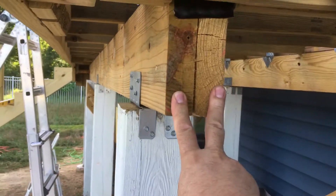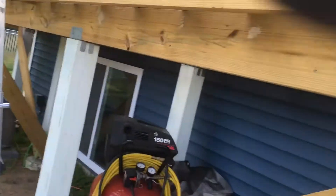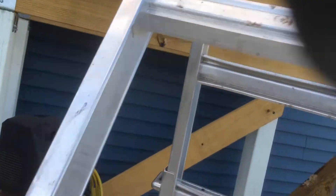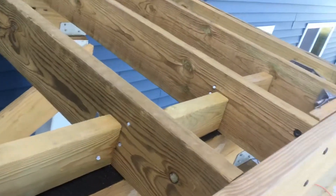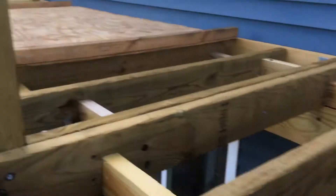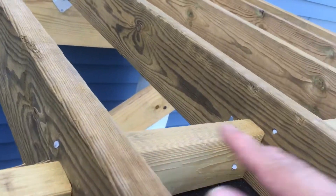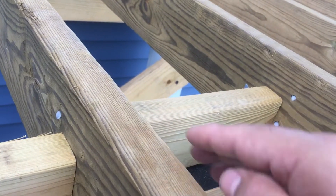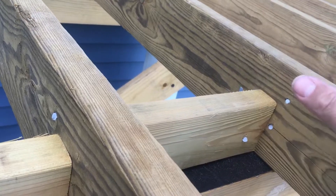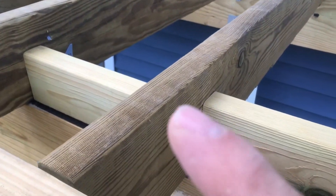It's freaking solid. We've got doubled two-by-eight beams — both of them are doubled. We already talked about how the joists were attached in the last video. We're going to talk about some additional structural work done to the back, primarily to stop vibration or movement. You'll see the blocking alternates the entire length on both sides. It's offset — not in line — because when they're in line you can get a harmonic wave of vibration that travels from one side of the deck to the other. Offset breaks that up, so dancing on one side you don't feel on the other.